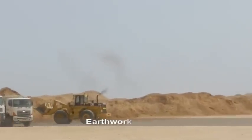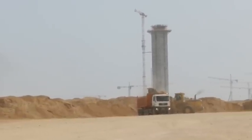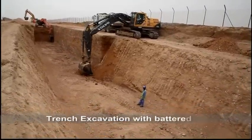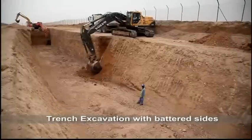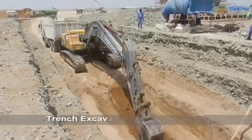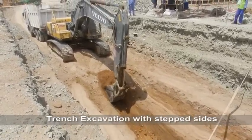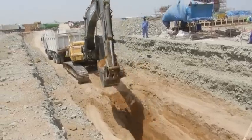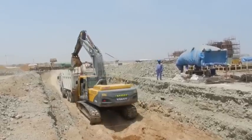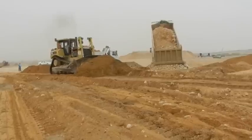Earthworks include excavations, trenching, haulage, backfilling, filling and compaction. Shown are loading shovels, excavators, rock breakers, dozers, graders, tipper trucks, rollers and a road milling machine at work. Excavations can be classified by the type of material, for example topsoil, earth, rock. Alternatively, may be classified by their purpose, for example stripping, roads, foundations, structures, underground, dredge, trenching.